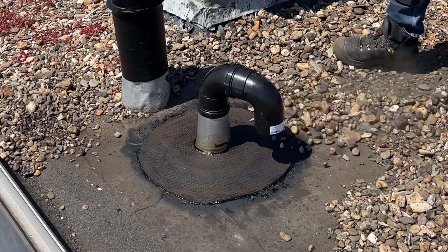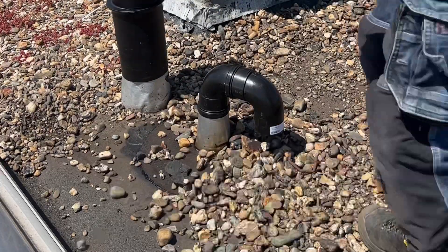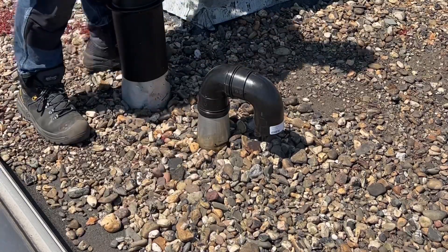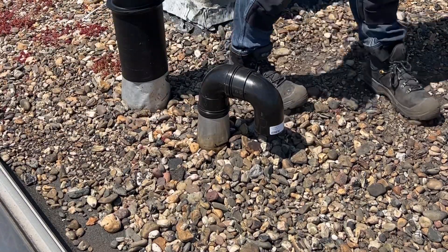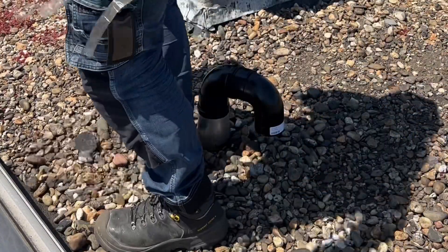Put back the gravel stones. Roof stones serve to protect the cladding from being blown up by the wind and protect the roof covering from UV rays from the sun. Because we use roof gravel, the roof covering can be loose and does not have to be attached to the roof construction. This makes the roof covering last longer.